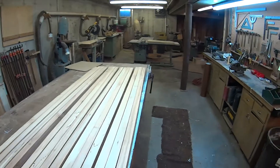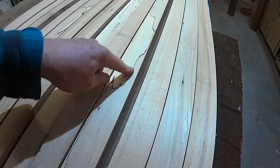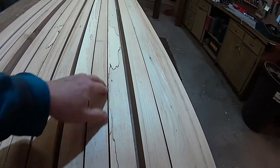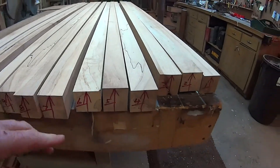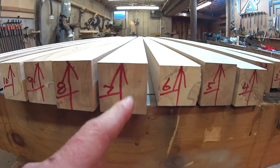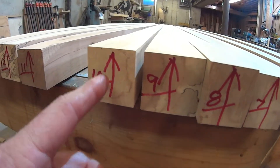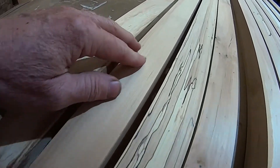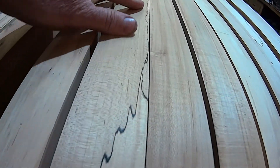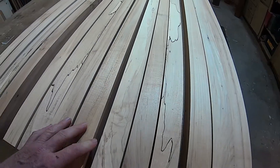Some beautiful maple boards here. In my opinion it's got this wonderful — I'm not sure what they call it, smolting or spalting — but it's got some really pretty lines in it. You can see I've carefully chosen as much as possible the quarter grain to be on the surface, so the grain on these boards is running as vertical as I can, and when you do that you start to get some really nice quarter sawn flecking or waviness, which I think is beautiful.